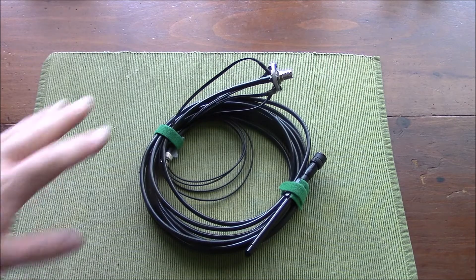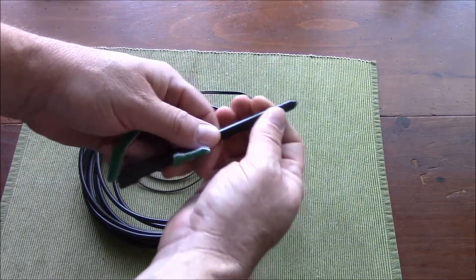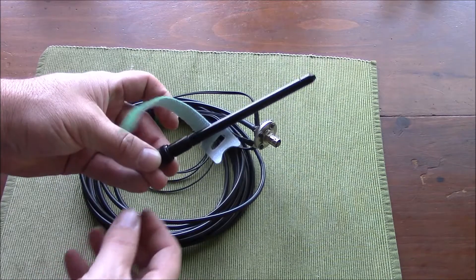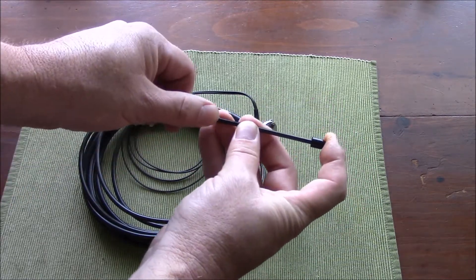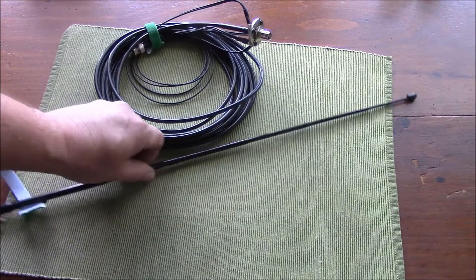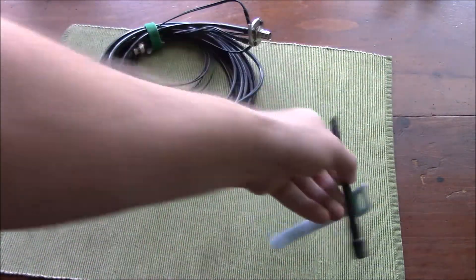Here is version 2.0, currently configured for transport. What I've used for a radiator is one of these simple telescoping antennas, which work pretty well and have more power handling capability — I've run 50 watts of RF through it with no problems. When collapsed all the way down you've got UHF; extend it fully, retract slightly, bring it down a quarter inch, and it's a perfect match at 146 MHz. You can pre-mark the length with a silver Sharpie and tune it for operation outside the amateur band if needed.